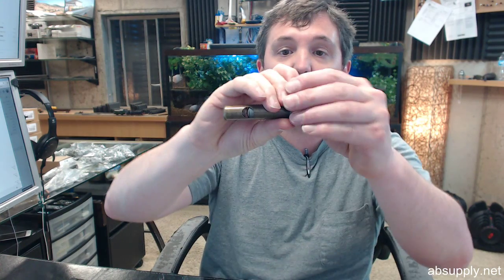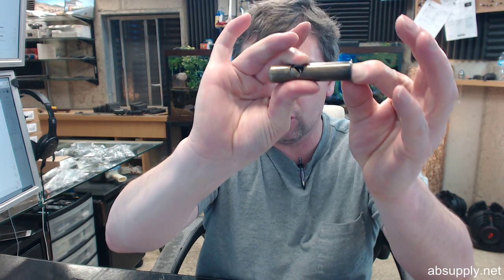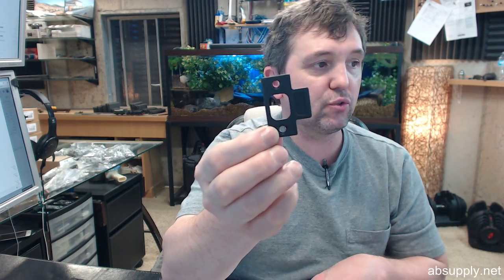Okay, after that you're going to have your latch bolt. It's going to look like this. It's spring loaded and it's meant to be loose like that. It can come apart. The installation will require that you push it in and you'll be able to force that odd shaped spindle down through that. We're going to go over that in a moment. And then finally your strike plate, tiny little T-strike that's here.